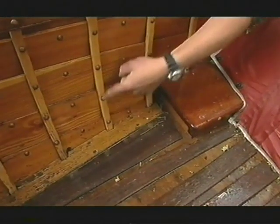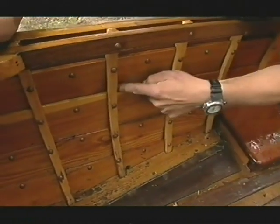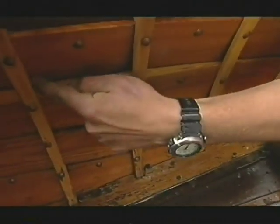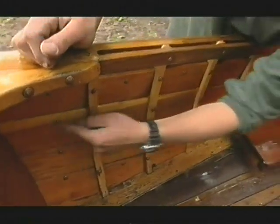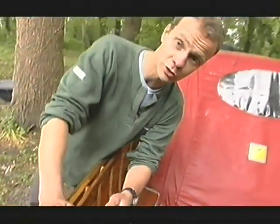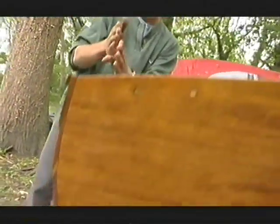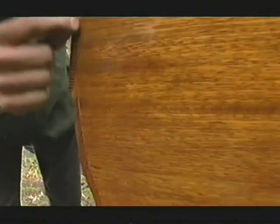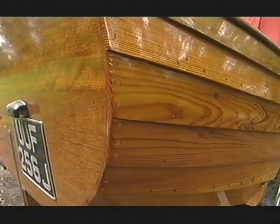You can see the timbers here which hold all these planks together as well. And if you notice behind each one is a gap. So if you imagine if you got to the end there'll be a hole. So what there is on the bottom of each plank is called a gerald or a snape, and very gradually the timber's taken away so it runs together to give you a nice seal around the outside here. You see here and here, and if you didn't have that, the water would get in, and that would defeat the object.